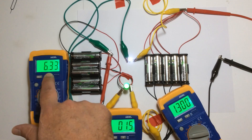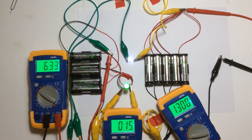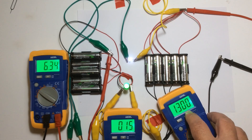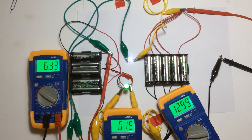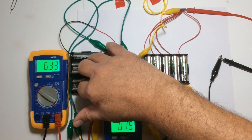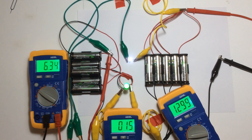If you go back and look at the previous videos, in update two we were at 6.6 volts. So the voltage is still coming down — it's taking an excessively long time, but at the same time it's transferring the power. In my opinion, these batteries at 1.3 volts are full — they're a 1.2 volt battery. What I should be doing now is swapping: take the parallel set, place it in the serial bank, and vice versa, and we can keep doing that for a lot longer than conventional use would allow.